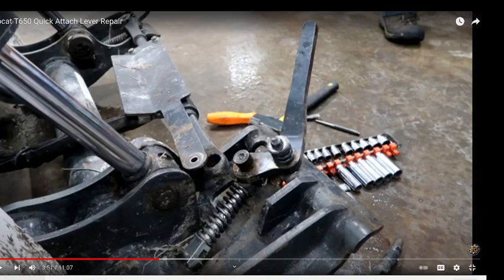It may have something to do with the way I had the quick attach set up, but if there's any flex in there, your implement's going to come off if you put too much force on it. And that's like half inch steel there. It's pretty solid, or like 3/8 inch steel. It's pretty solid, but it's just not designed for scaling up to much heavier implements.